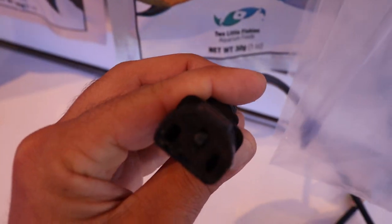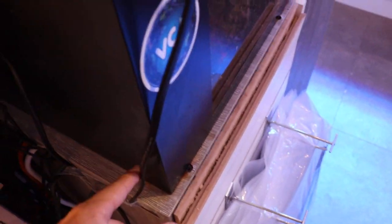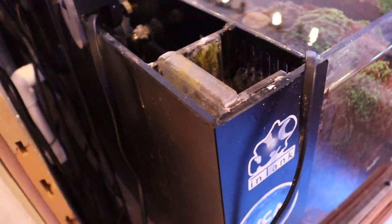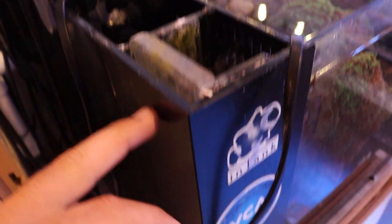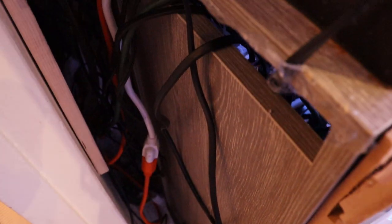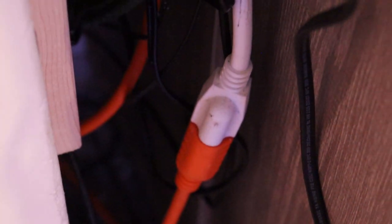Here's the other end, what it looks like. And that was due to our fault — it was just salt creep building up behind the tank, so the wiring wasn't done terribly well. I'll take blame for that. Salt creep often builds up behind aquariums naturally; you get salt kind of building up. The power bar was just hanging out loose, and over time the salt got in there and burnt the plastic. Not good. It could have been much worse, obviously. And this, as I'm showing you here, is also not safe — a lot of these wires, the way they're running is not safe.